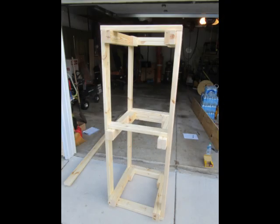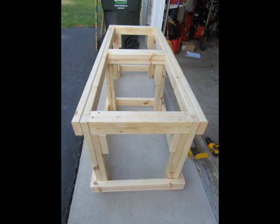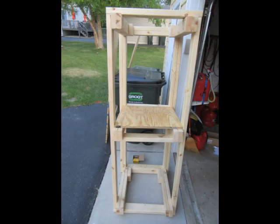I also put a stabilizing board front to rear between the bottoms of the two middle legs. I've now added front and rear belly boards, which are a second layer to the front and rear top support boards — just making them double thick. Having an overlap like layers of bricks this way makes it more stable. In spite of all of that, I decided to do something to prevent the table from tipping forward or backward: stiffening it up by putting a piece of leftover plywood screwed to the middle legs, so any tendency for the whole thing to lean forward or rearward would be arrested by that plywood piece.